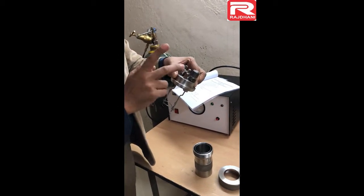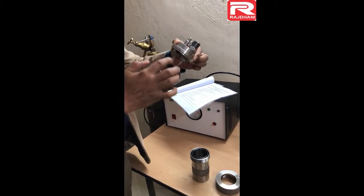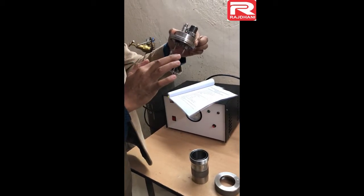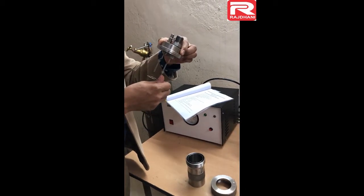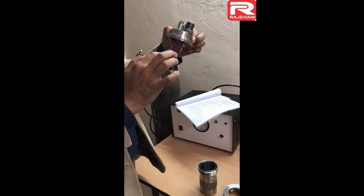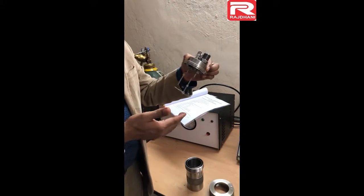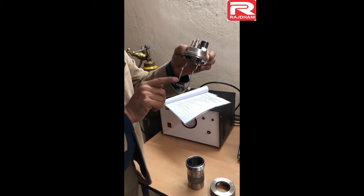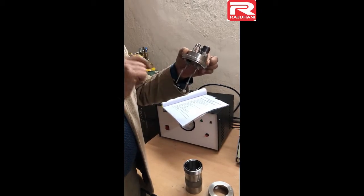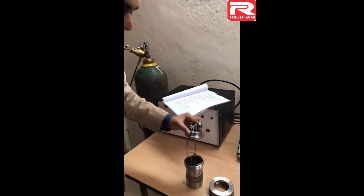These are the two terminals — we call them bomb terminals. These are used to make electrical connections; electrical lead goes inside these bomb terminals. These are two electrodes: one is a smaller electrode and this is the larger electrode. You can see the ignition wire which is tied between these two electrodes. And this is called crucible ring — the crucible ring holder with SS knob. Be careful that this crucible ring should not touch with this smaller electrode, otherwise our sample will not burn. That is why this electrode is larger and this electrode is smaller. Always keep some distance between this ring and the smaller electrode. This completes our SS bomb.